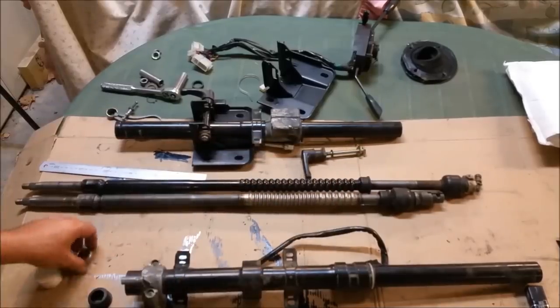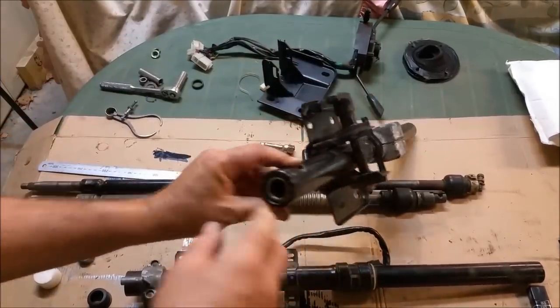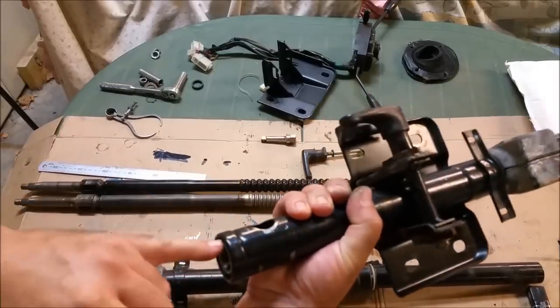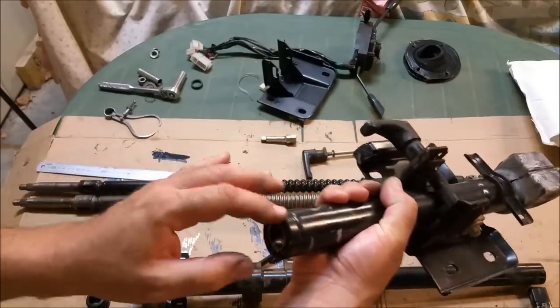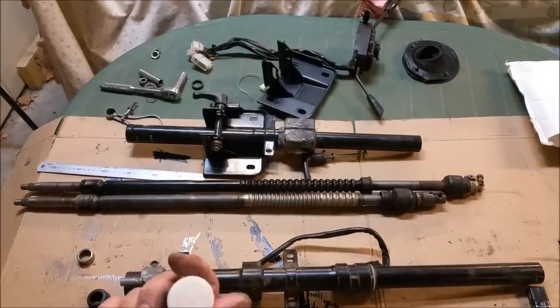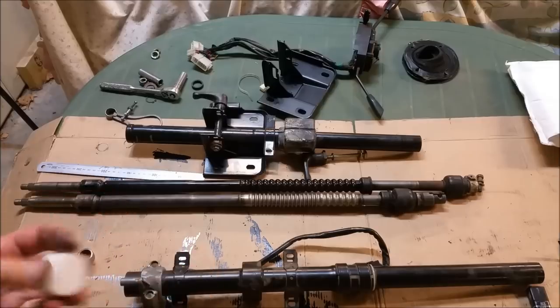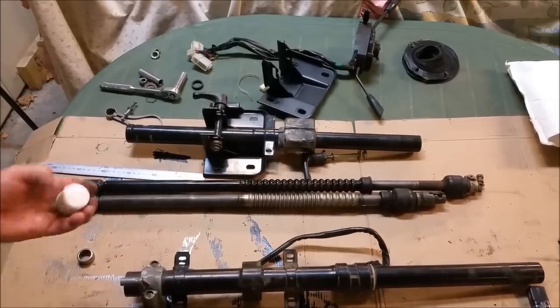The original GK column had a roller bearing that's been crimped or rolled in to stop the bearing moving further down, and it's also been rolled at the end, so it's non-replaceable. So this is what I'm thinking: Delrin Acetal - I can make a bush with minimal clearance but good clearance here. This stuff is wonderful, you turn it on a lathe. With a shoulder on it so it goes into the column.